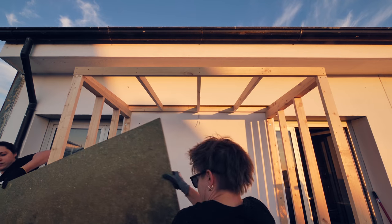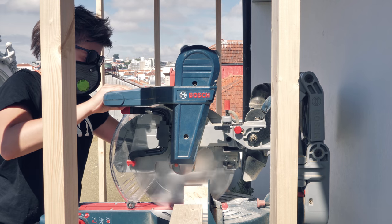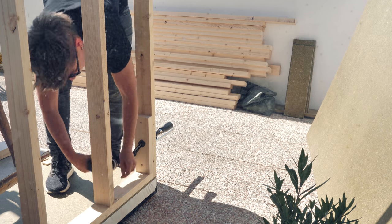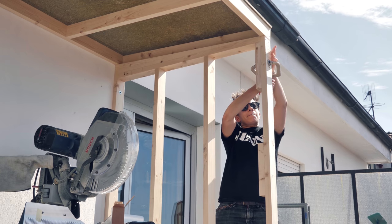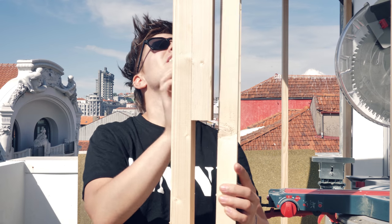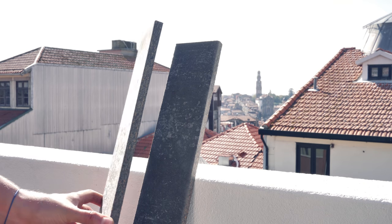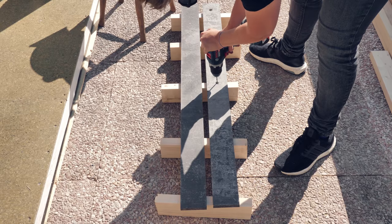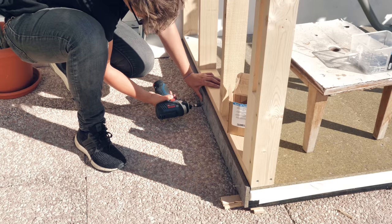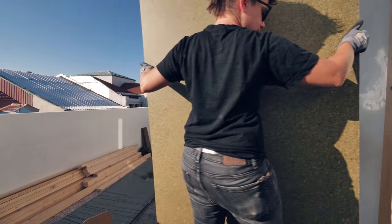I called for help to place the top board in place and had to patch another vertical piece because the sideboards were previously cut too shallow so I could fit them inside a building elevator to bring them up to the studio. Before applying the sideboards I thought it was a good idea to create sort of a footer, and for that I used some scraps of cement and wood fiberboard I had. I drilled some holes for screws and attached them leveled, so I can rest the board on the footer and simply screw it to the frame.